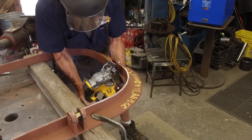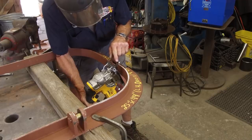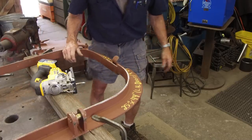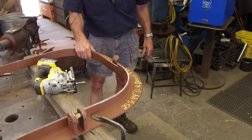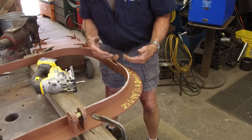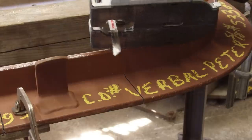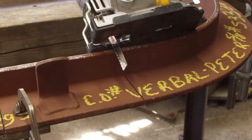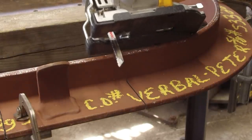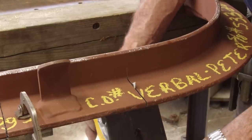I was pulling back this way because I'm starting to dull slightly here, but I know I have good teeth out here where it hasn't been cut, so I kind of gave it a little bit of a pivot — that kind of worked out. We're going to put a piece of metal here with another couple of clamps holding it in the same position as it was before that cut was put in there. You can see where the majority of the wear was on the blade, and I'm starting to pull it so that I'm working the fresh teeth — it seems to be working okay.